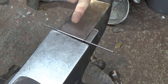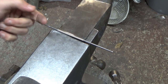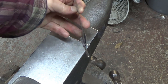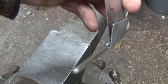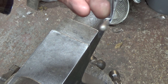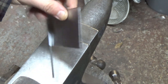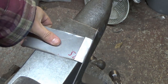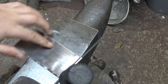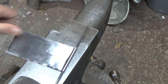Just neatens that edge up. Bear in mind this edge won't be seen but I want it crisp against the side of the vambrace. Don't go too far with this because the temptation is you keep going thinking it's looking nice and crisp, and you're actually putting that metal underneath this piece, which we don't want. We want it to be just about square. Get it back over the anvil, dress it back, tamp it down, and then remove this and do it again.